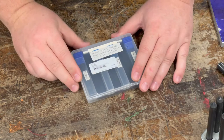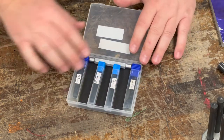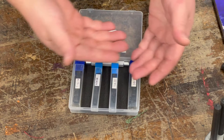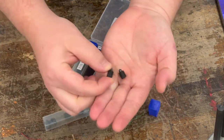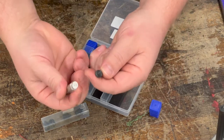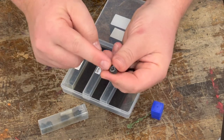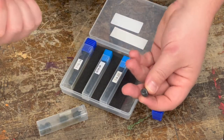This is a set of transfer screws — you can get them pretty cheap on Amazon, I'll drop a link in the description. They come in multiple size threads: 7/16, 5/16, quarter-20, 3/8-16. This set is about 40 bucks. These are screws with a hardened tip and a hex that lets you use a normal driver bit to screw them into your project. Then you tap your project and it transfers the screw hole center locations into your workpiece.